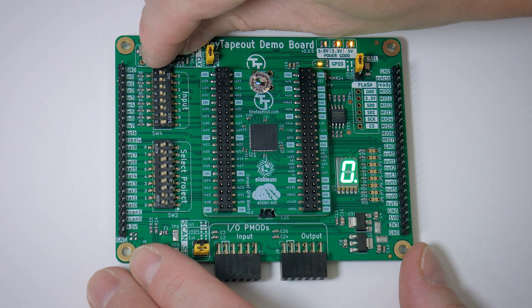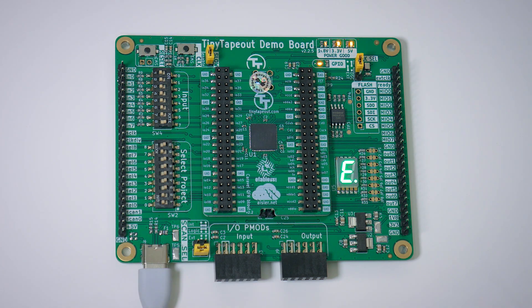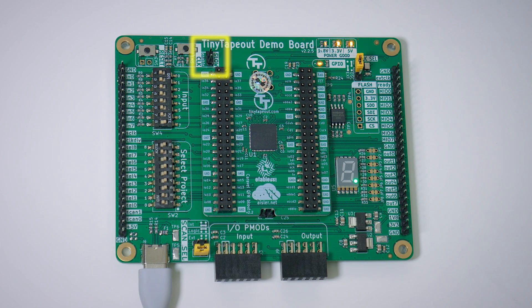With the reset button pressed and asserting the IN1 signal, this hello design actually uses the signal for its own clock divider option, hence slowing it down a bit. The clock button can be used to send individual clock pulses via IN0, but with the slow jumper connected, the ASIC is actually generating that IN0 clock internally. If we remove the slow jumper, the GPIO LED keeps blinking but the design halts, and the clock button would now allow us to single-step the design's clock. Now let's explain how we can change the generated slow clock signal by dividing it — an important testing feature that is part of the ASIC itself, not of this one design. When replacing the slow jumper, or when powering up the board, the rising edge on the slow clock enable signal causes the binary number presented by the input switches to be sampled and latched at that moment, used as the input value for the slow clock divider, before the inputs are then fed directly into the design.